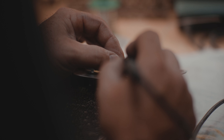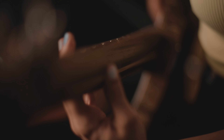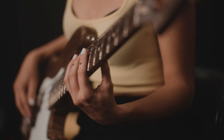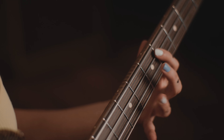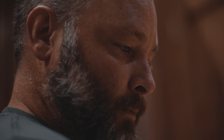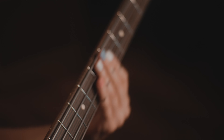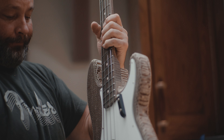It's fun — I've always enjoyed this. For me, this helps me become a better builder. I'm able to figure out what works and what doesn't in terms of tone. There's a reason why we use maple for the neck, and that's obvious doing something like this. It's a big lever out in space with a bunch of tension on it. The Strats are around 150 pounds and the bass could be anywhere from 150 to 200 depending on string sets. That's a lot of leverage pulling on the neck, so we want to keep it in the hard maple world — that's really the strongest we could put on there. Every time I do a weird project like this I feel like I get a little bit better in terms of understanding the concept of the instrument, and I always make sure that it is true to what a Fender is. It has to be the same and all the components fit through and through. Yeah, it's a P-bass.